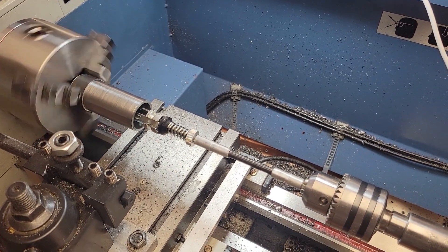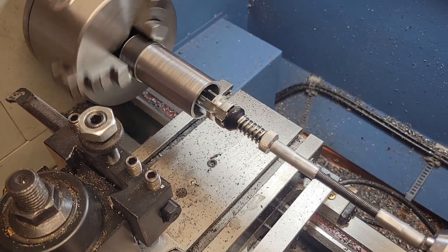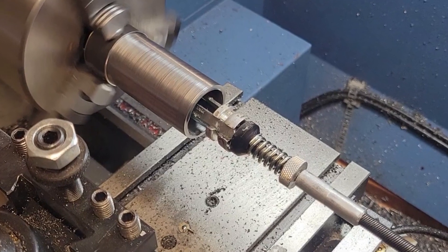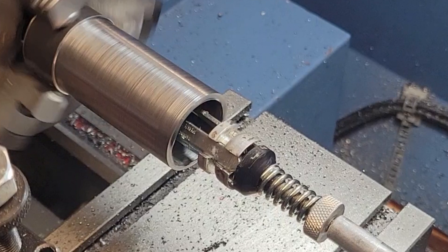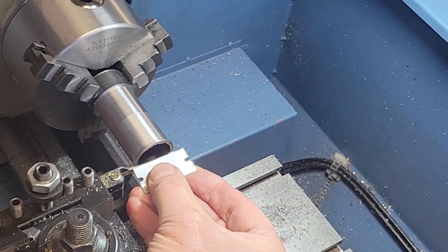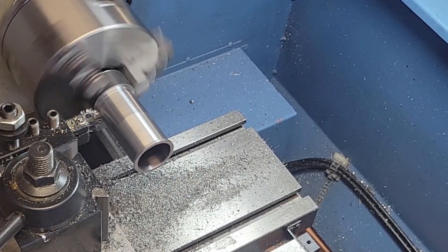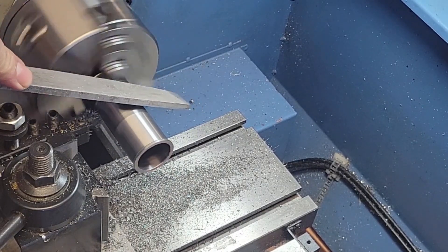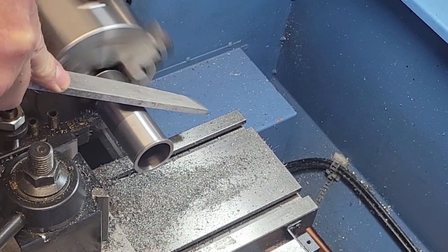There's one last thing we need to do before we can part off our cylinder sleeve: we need to hone the inside of the cylinder. I use a brake hone designed for a one-inch internal diameter brake master cylinder, with fine-grade grinding compound and a little bit of oil, and let the lathe do the work, moving the tailstock in and out. This 1144 steel is pretty hard, and it took me a fair amount of honing before I was happy with the surface. Then I use my trusty razor blade again to set the zero point of the parting tool and part it off. Before we've completely cut through, I like to hit the bottom of the cylinder sleeve with the file again to take the burrs off — it's easier to do now while it's still spinning in the lathe.